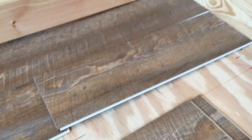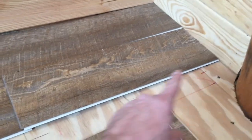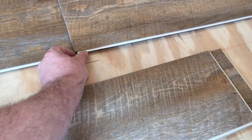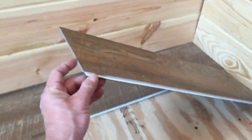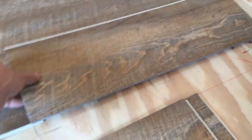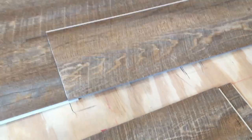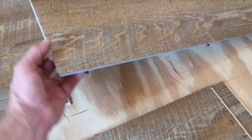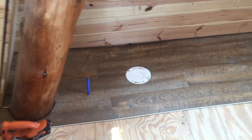Okay, it's kind of an elementary thing here, but an easy way to get your measurement for your tile, whatever I'm doing here, engineered luxury vinyl. When it's left over, you can see that there's much overlap down here. So what I need to do is cut off this length to make it drop in there, but I can't cut that off because this has the groove and it has to match this groove. So I can't cut off that side. So what we're going to do is just flip it around, and you could also use a tape measure and everything, but this is a good way to go. Then you just mark it at this point, which gives you your line to mark off the side. So you cut this side off, and then when you install it, you'll flip it back around, and then it'll fit in the hole, and you'll have your right groove on this side and this side that matches here and here.